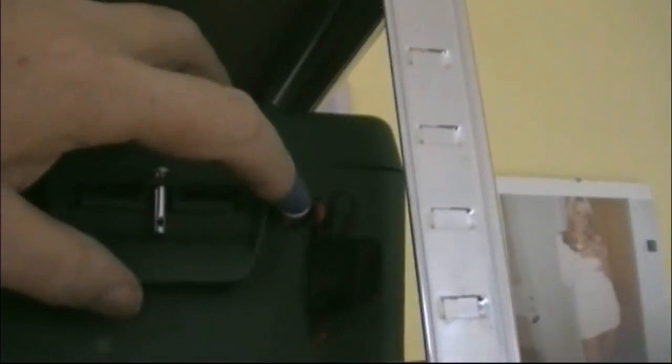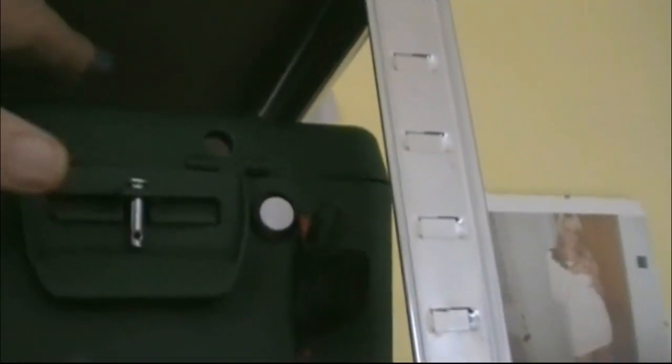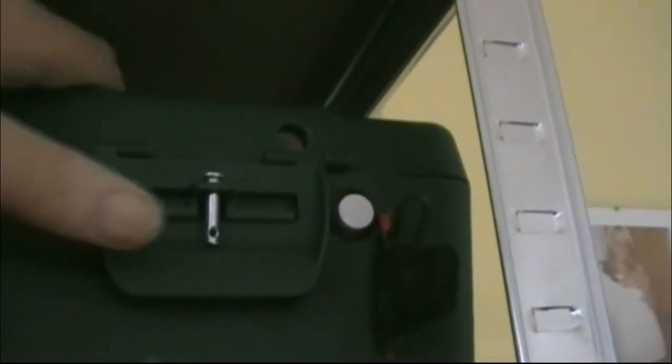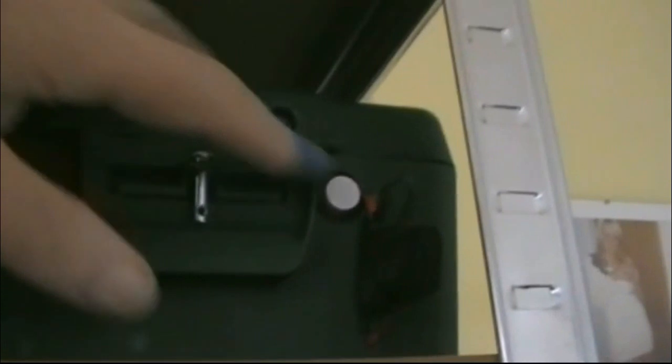If you're wondering what these white push buttons are for — they are to press when you look through the window to see if the fuse is blown. Because otherwise, if a fuse had blown it might be on all the time even if you hadn't checked for a week. So what I decided to do was interrupt it with a switch and diode-feed them all down to the negative rail through the push button, so when you press it you can check.